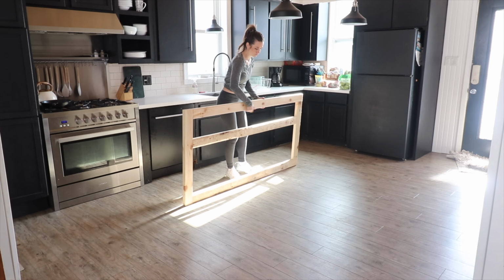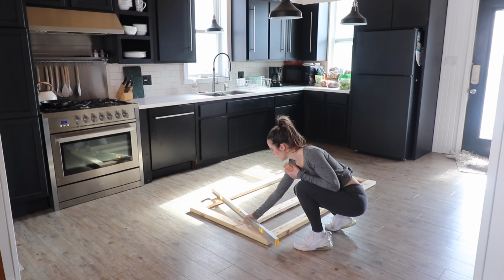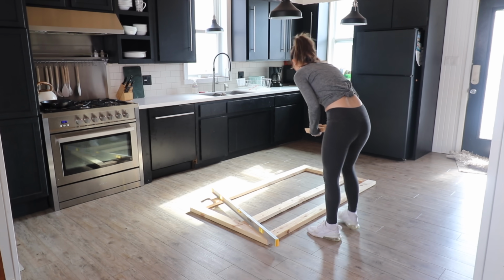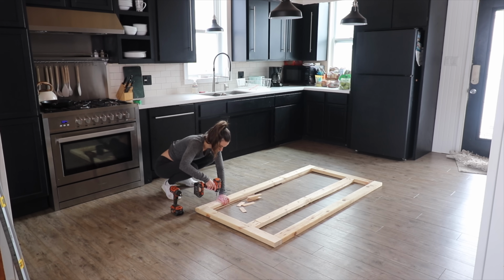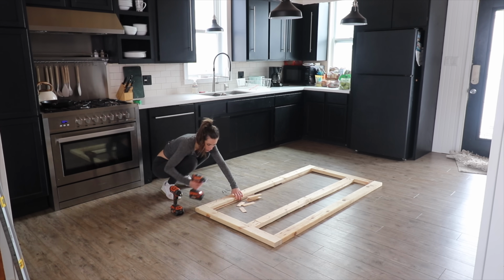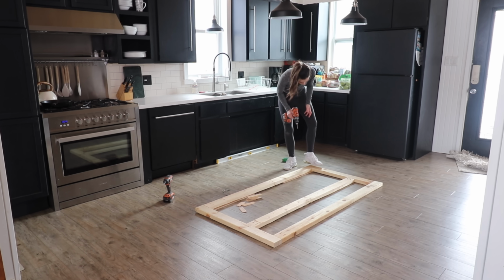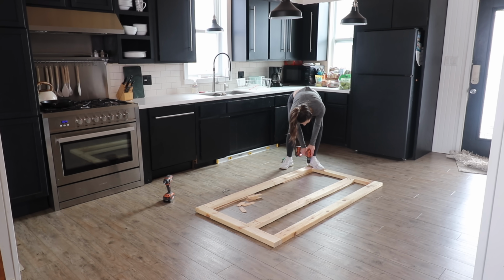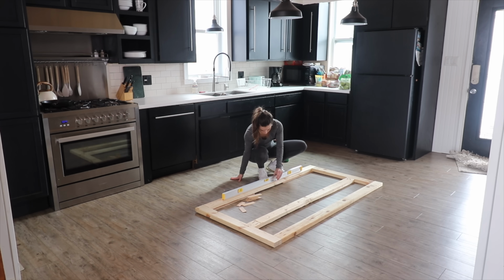The floor in here is crazy unlevel because the foundation under this kitchen is more than 130 years old. I used scrap plywood and shims to level my base, and I screwed it in through the floor with a screw long enough that it would hit the subfloor. My flooring is a glue-down LVP. If it was a click-together floating floor, I would have had to remove it. With one side of the island 1/2 inch taller than the other, it was finally level.